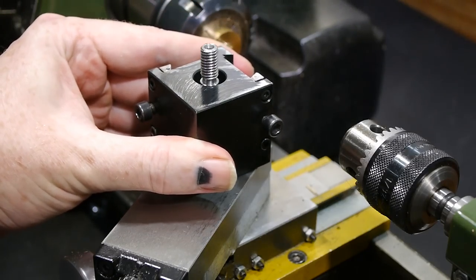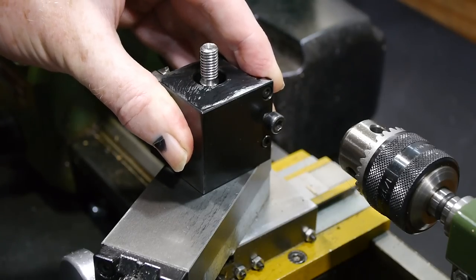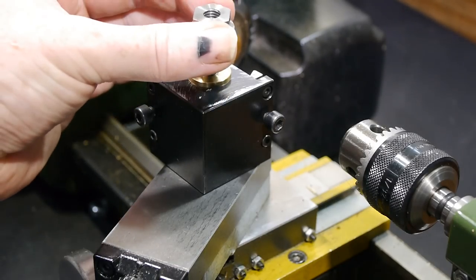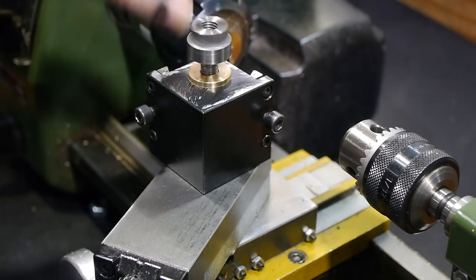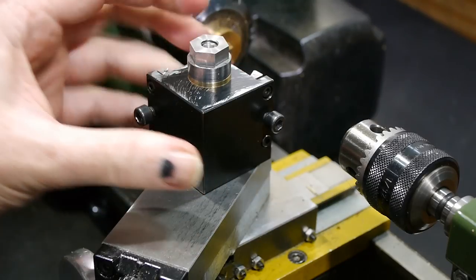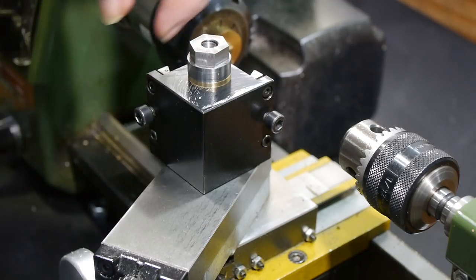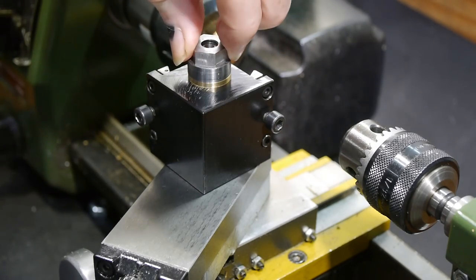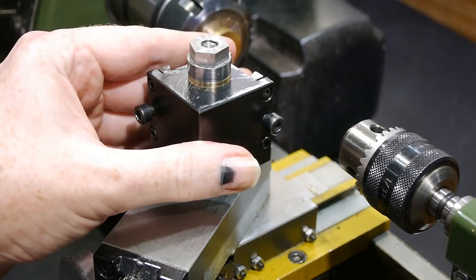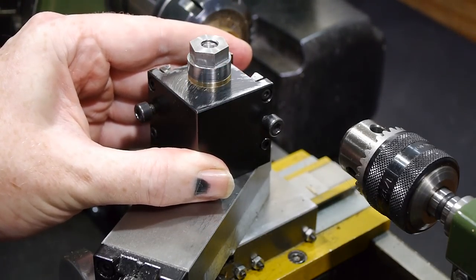Now, with the toolpost in place but completely untightened, it's extremely stable, and while it will rotate freely, it doesn't shift around or wobble. Held in place with this custom nut, which is intentionally much wider than the bolt, so the down clamping force is more widely distributed, making the toolpost more stable. The washer adds a little more stability, so that when the nut is being tightened, the toolpost itself is even less likely to shift than before.